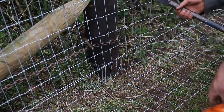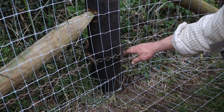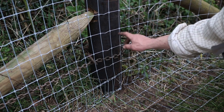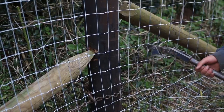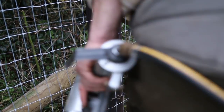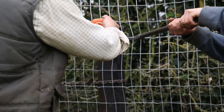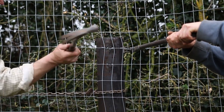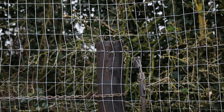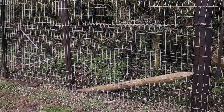One little tip here: because you've got the chains around the post, we tend to leave the wire below and above - we don't do them until afterwards after we've taken the chains off, otherwise it becomes too tight and you can't pull the chains out. So miss the bottom one and the one above it, do the rest all the way up, same here - miss that one and that one, come back and do those a bit later. And that's it - that one stretch done. As you can see it's all tightened up. We'll take the clamps off now, go around and staple up the last post, and put a couple in on the struts as well. Then that section is done and we'll just repeat that all the way around the whole site.